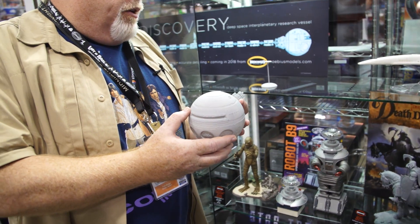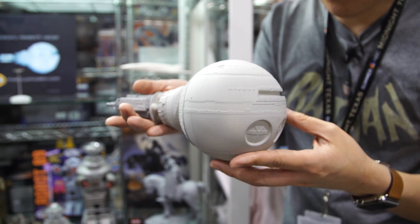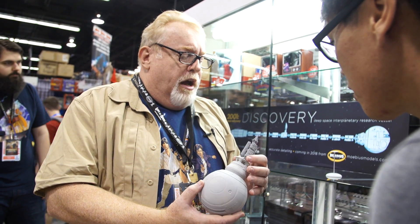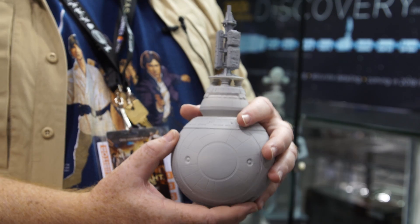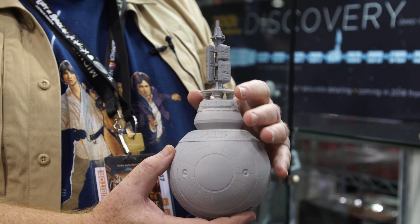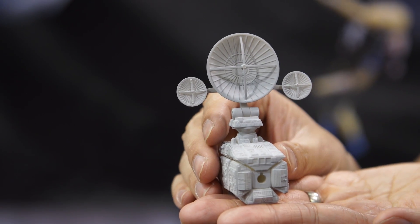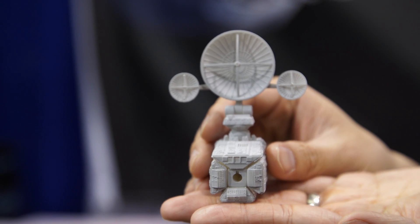The way we're looking at it right now, it's broken down into about 620 pieces. So it's going to be a huge kit. To get all the detail and the tanks, the amount of separate pieces that had to be made — since we're limited to working with steel tooling, there's only certain shapes that will eject from it. The breakdown, that was really the tough thing. You start with a 3D model and get an expert in to start breaking it apart, do the engineering work to see what will eject properly — the draft angles, the flow for the tool, all the real tough things.